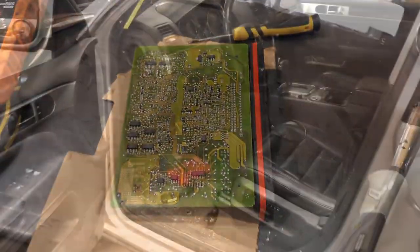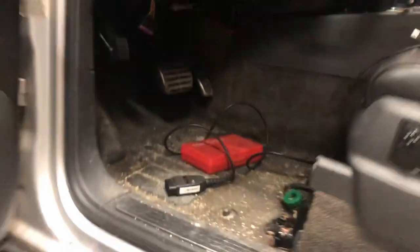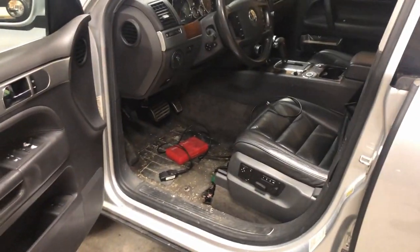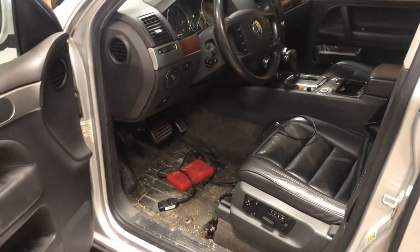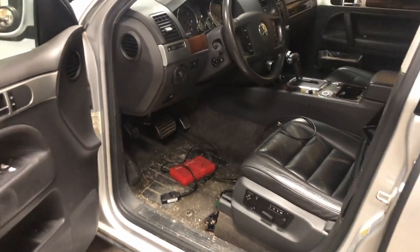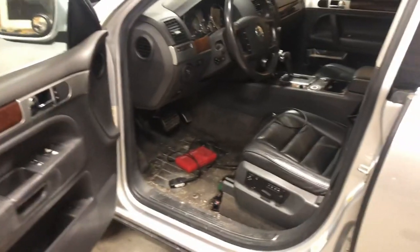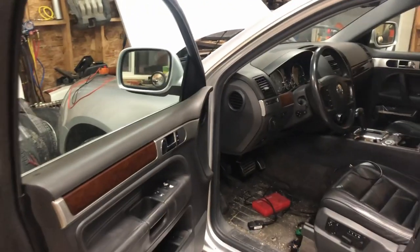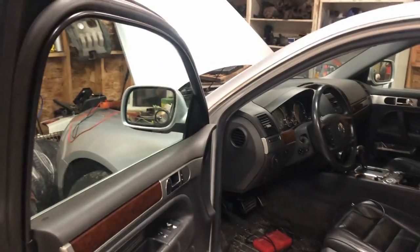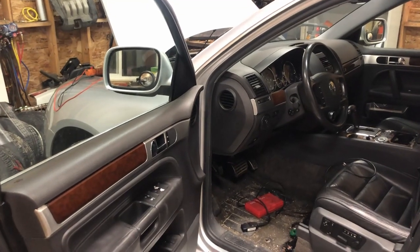We'll plug that in and see what happens. I killed the battery a bit more here, so I'm just going to get this KESSY unit put back into its home and scan it later after the battery charges for a while. Once you get it back in, scan it, clear the codes, and see if you have an antenna fault again. If you do, then more likely that antenna is actually the issue — but with multiple antenna faults, it's pretty certain this repair is going to fix it. That's the end of this video. I'm hoping to bring my beige one home — that should be some more engine-related issues with the V10. Stay tuned and subscribe if you want to check that out. Thanks for watching.